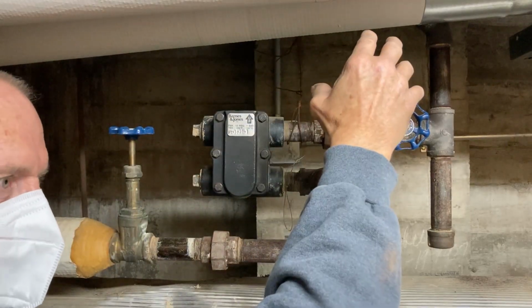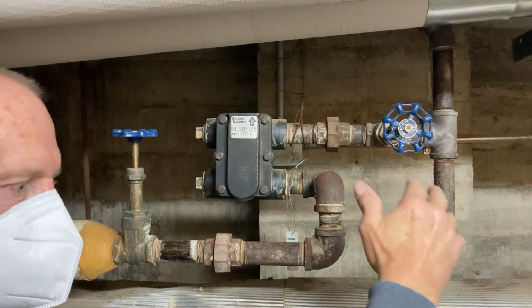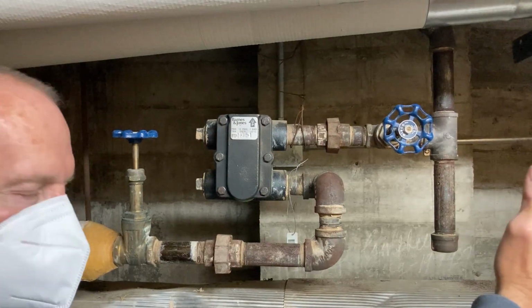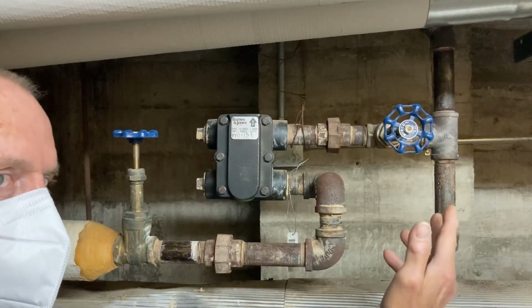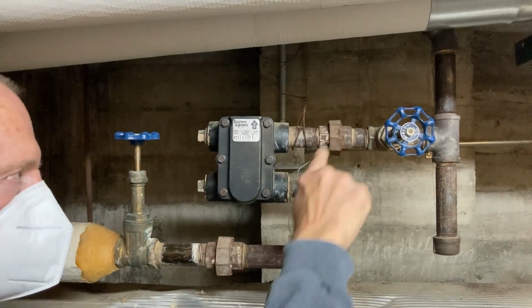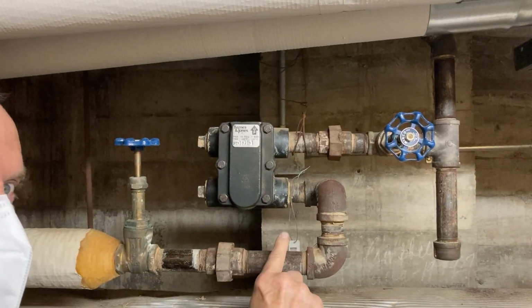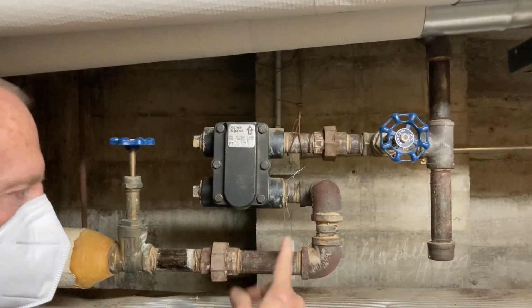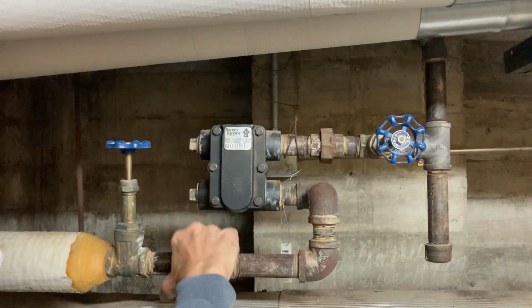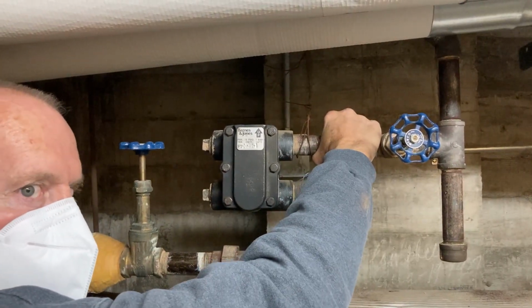So when the steam comes in, the heating source for your building cools that down. The condensate goes down to the bottom. If you don't get rid of it, if it plugs up, you have no heat. Now, then you have the opposite problem, that if this is just wide open, now you just have steam running through it all the time. Actually, that's where your energy efficiency really comes in, because you'll just have steam coming out the other side of this pipe. This side of the pipe is open to the atmosphere. This side is the steam line coming right in.